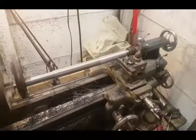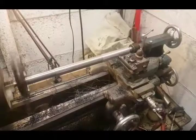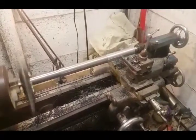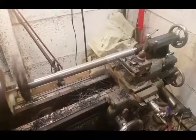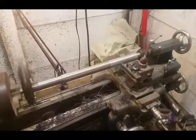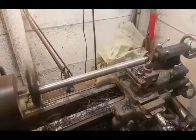I've flipped the crankshaft around now and I'm machining the other end — this end is also down to 0.9 of an inch. I find with this EN8 that if I take 10–15 thou cuts it does leave quite a good finish, but as soon as you try to take a 1–2 thou finishing cut it's absolutely horrible.